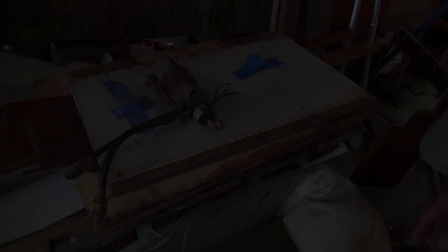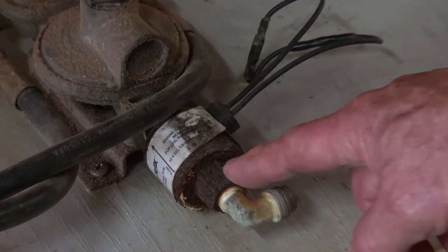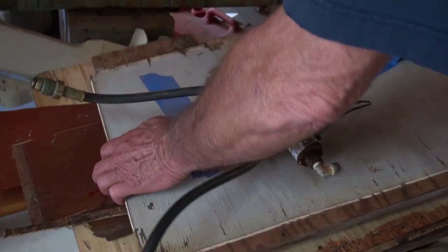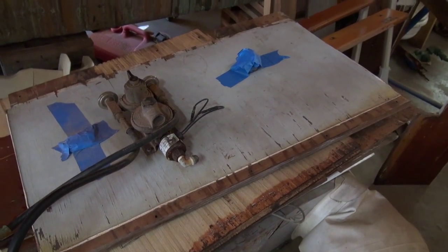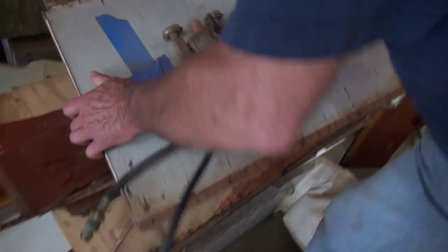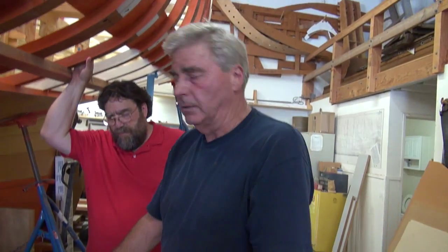We're looking at the manifolds for propane. You've got your little gauges here, but this was about to go — really corroded. You have an iron fitting with a brass or copper fitting attached to it, which speeds up the corrosion process with a bit of galvanic action. There was also an electrical propane on/off switch. The line that goes to the stove goes out here — it's still up on the boat. We don't know the age of that, so rather than take any chances, we'll just replace all this stuff. And this is the little bulkhead we changed — it wasn't horrible but it was just crappy enough that by the time we cleaned it up, we could make a new one, so we just made a new one.